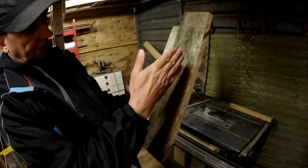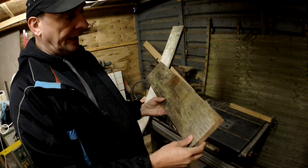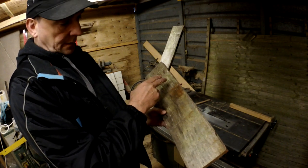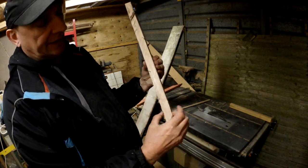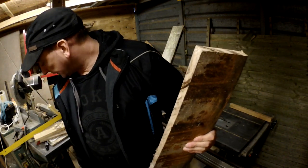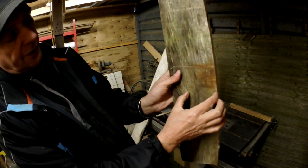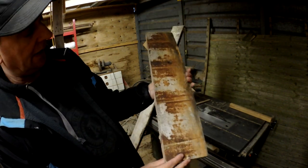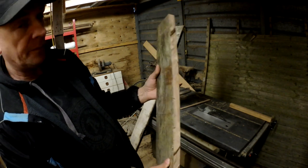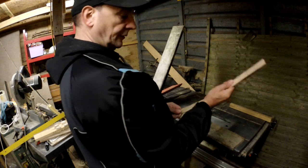This will be ideal. What I'll do is cut it square - it's got a curve on it so I've got to cut it square, then thin it down. I've got a plane there but there's a problem with it, so I'll probably just run it down the saw because it's not going to be that wide anyway. Then that will go in the boat and be fiberglassed over.